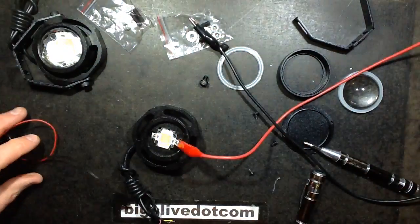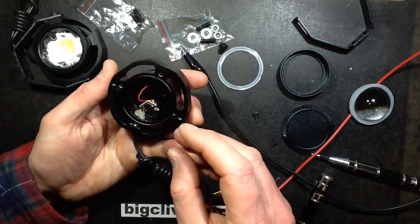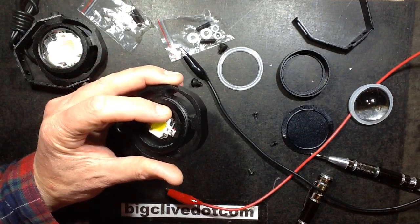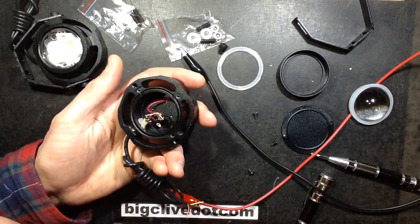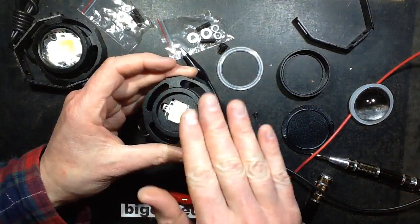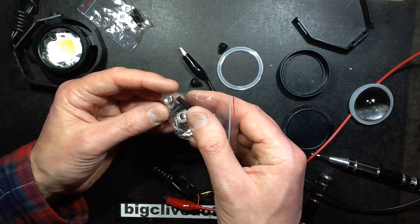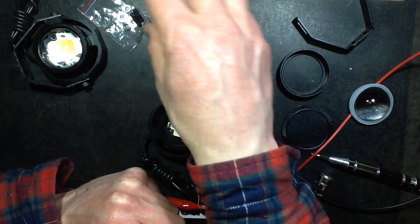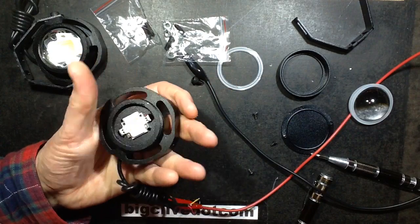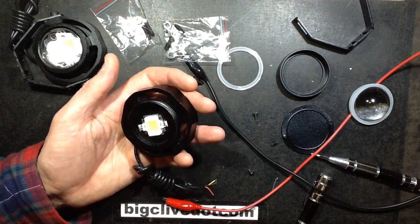Having said that, I bought this because I like the aluminium housing, the lens, and the overall build. It's a good base to start working on — I'd prise the LED out, get rid of the flashing, maybe put a decent coloured LED in, and use them as positionable indoor lights because they produce a nice splash of light. They come with mounting hardware — basically universal-length studs with nuts on either side. The quality of the LED and drive circuitry is dubious, but it's a good toy and a neat little starting point.